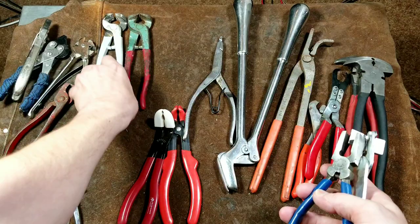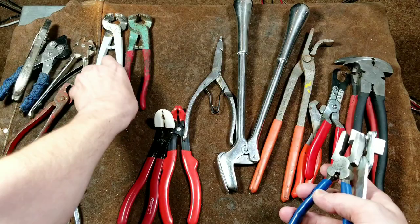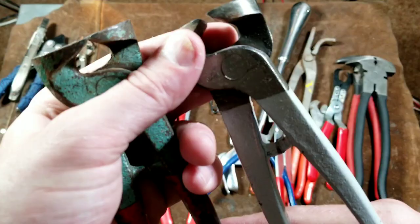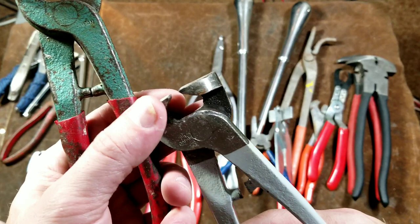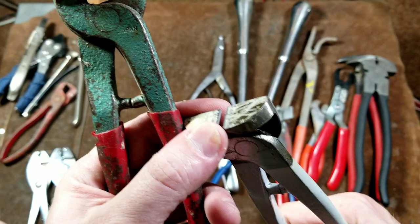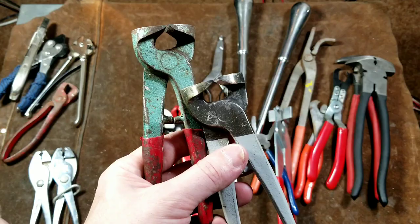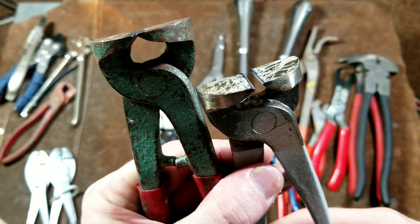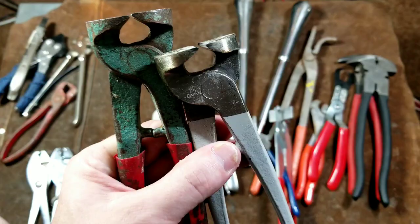We have a small collection of four pliers related to glass and tile. These are tile splitter pliers — both Japanese made. If you ever see these, they're the odd pliers where the jaws don't come together and they have carbide teeth centered into the end of the jaws. You grab the edge of a piece of tile, squeeze, and the hard carbide will chip and either break the tile or allow you to pry and shear or fracture it. Surprisingly expensive in stores, but invaluable for fine adjustments to tile, stone, and slate.